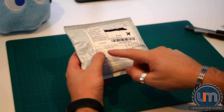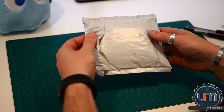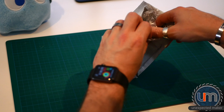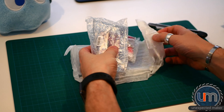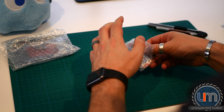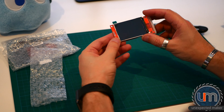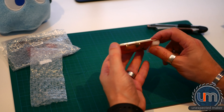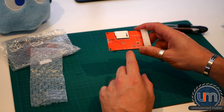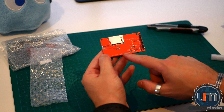What is this next one? It says two modules — it's an eBay purchase. I have no idea what two modules they are. These are little TFT screens — 2.4 inch TFT screens. I thought it had a micro SD slot but it's actually a standard SD card slot at the back. They run through an SPI interface. As you can see, those are the headers there. And they've got a 240 by 320 resolution.